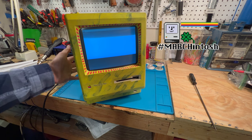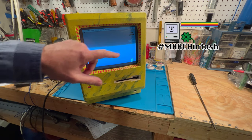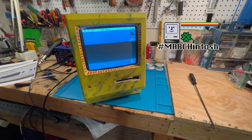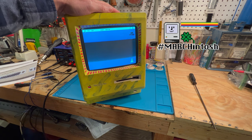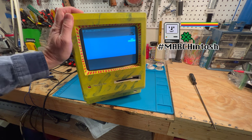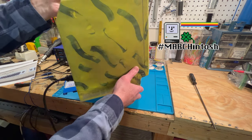Like I said, we left that 5 volt just a little bit on the high tolerance side, and the 12 volt is in tolerance where it needs to be. So you can see the blue SCSI there. You won't see the Rominator because I didn't hold down the R key to engage it. But it is working. And yeah, so we're all set. So I'm going to play some games on this, and I'll have that on another video coming this March on the MacPlus. Just got to figure out a little bit better way of showing it to you on the screen here. We'll have to do some special effect to get that to look good. But like I said, we are on the blue SCSI,